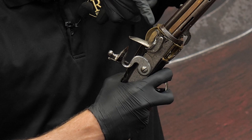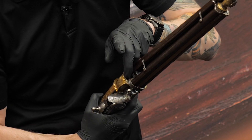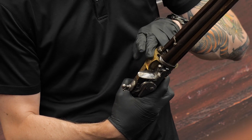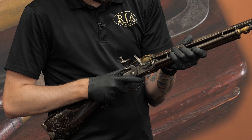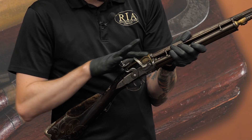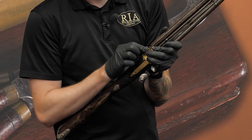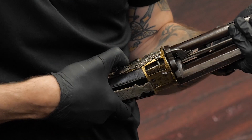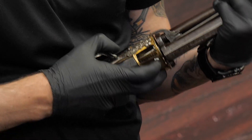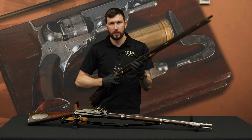As these magazines pass by, it's actually dropping priming powder into the pan to prime it. You can see right here at the front there's a hole, and as this powder magazine comes by it's going to drop powder into the breech chamber — that's your main powder charge. So as it cranks, you're dropping the priming charge into the pan and the main charge into the breech section. At the same time, a ball is dropped into a small compartment on the side of the frame. There's a little plunger arm that actually pushes the ball into the breech end of the barrel.